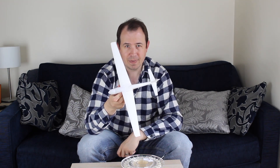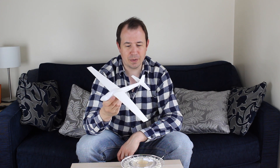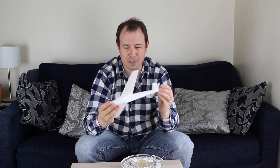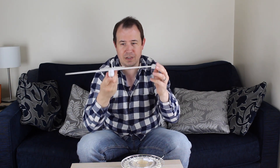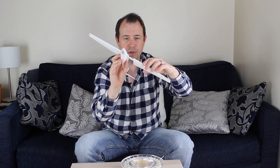I had a go at what you might call a chuck glider — the idea was you can throw this. I tried throwing it and it's completely unstable, so I've got some design properties wrong. I confess I designed it by eye rather than by calculation, which I'll do differently for the proper design. But the important thing is just proving you can make all the shapes necessary to build an aeroplane. This foaming PLA is reasonably strong — I can bend the wings and they'll bow a bit. The wings are mounted on little spigots and not glued on, and I'm quite pleased with how strong that is.